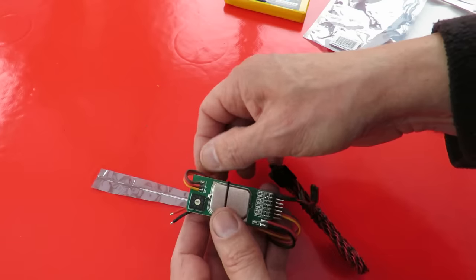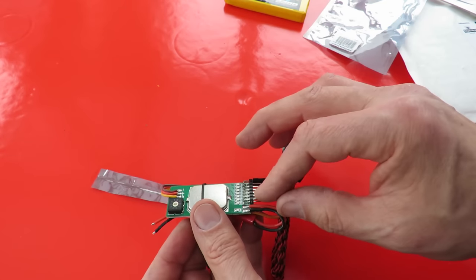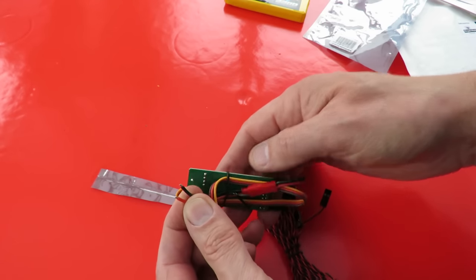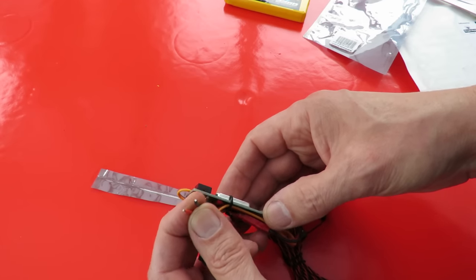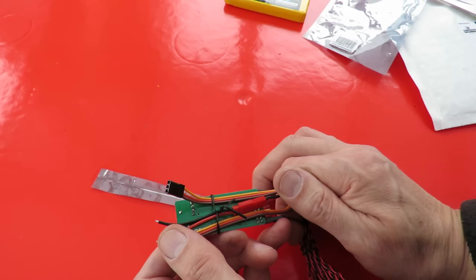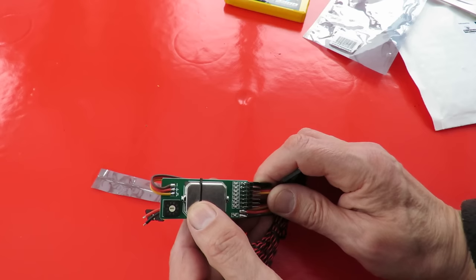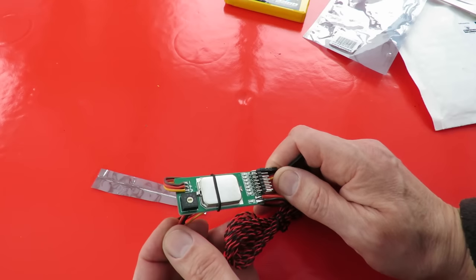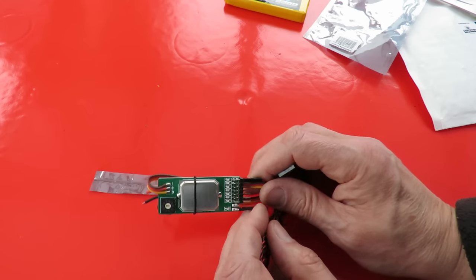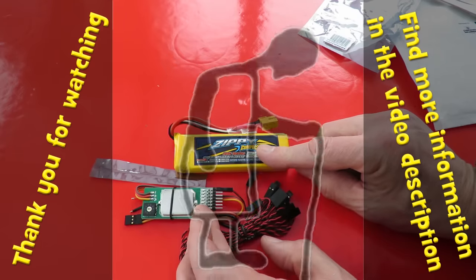The control itself is powered by your normal servo port, and the on-off switch, or at least the power that you're switching on and off, is supplied on these two wires, so you can put virtually whatever power you want into the on-off switches, within reason. I think the demonstration video I'm going to put in the link uses a 3S LiPo to actually supply the power to turn his lights on and off on his model aeroplane. So, a more powerful LiPo battery and a fancy on-off switch.